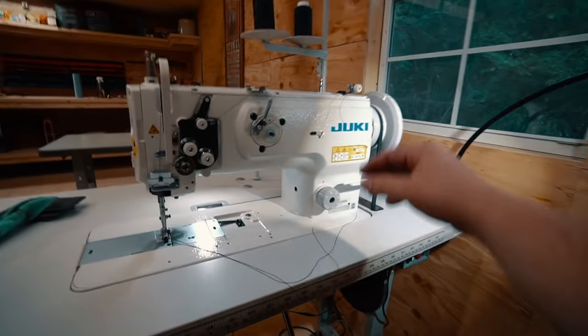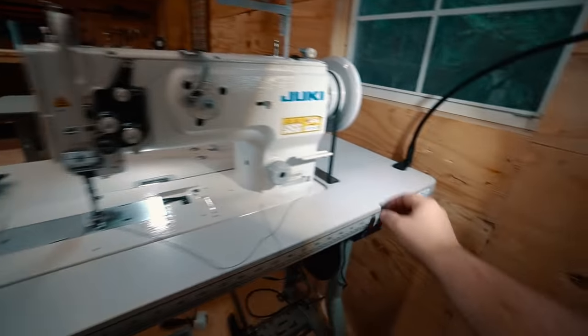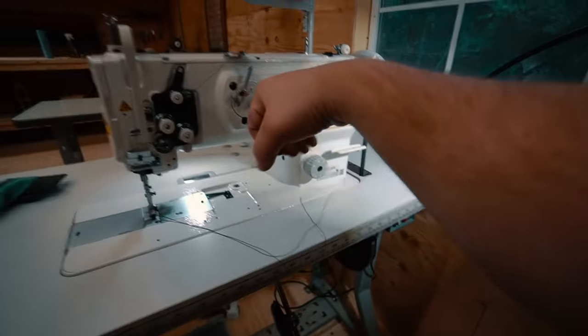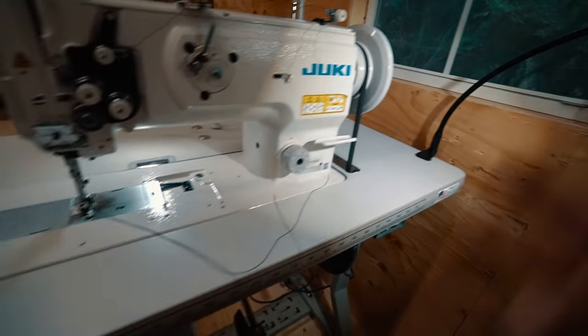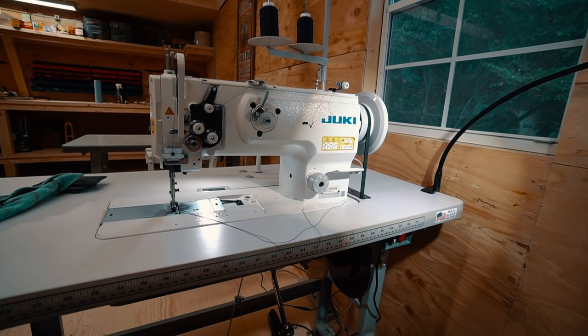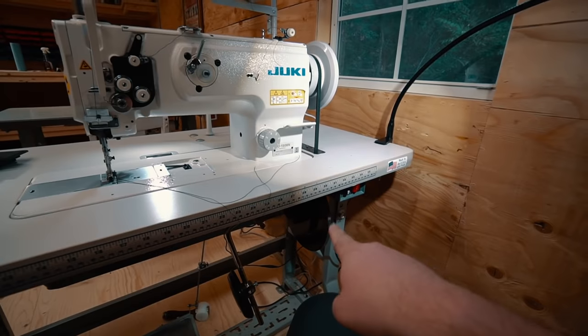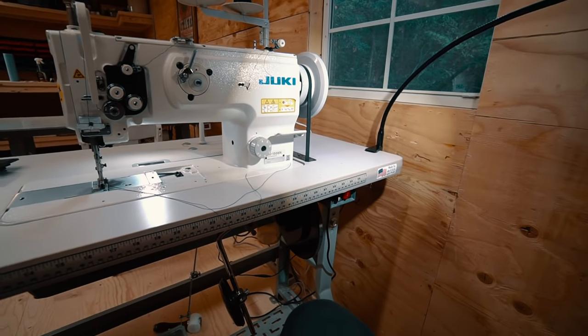You can, of course, get access to it. You just have to stand on that side of the machine, grab from right here, put your knee up against the table, and just lift up on it backwards — that way you'll be able to slip that belt off and you should be good to go. So if you're going to be using this machine for the type of work that we do, I would definitely recommend buying a reducer and I'll put the link to it in the description. I got it from eBay.